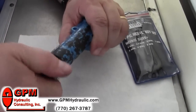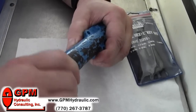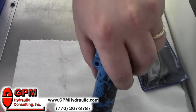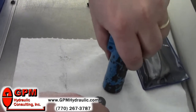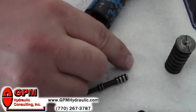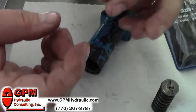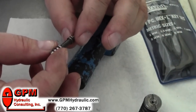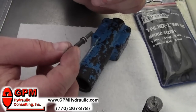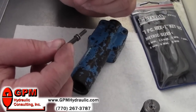We have the compensator off of the pump. To remove the spool and the spring assembly, back your compensator adjustment out, give it a little tap, and bring the spool out — and look at that, we found some contamination. Not really sure what that is, almost looks like needle bearings, but somehow that has become lodged in our compensator spool and caused it to stick in the open position. That ported our oil to our stroking cylinder, moved the swash plate back, and the pump was putting out very little flow, so we had a low pressure situation.